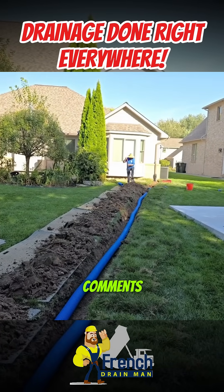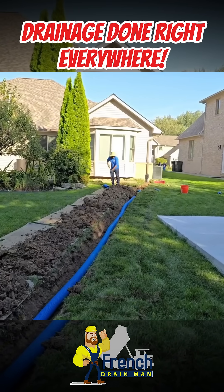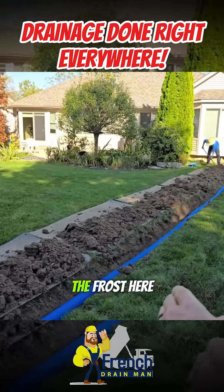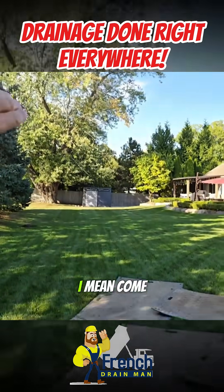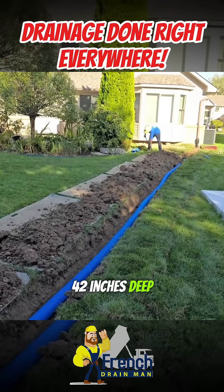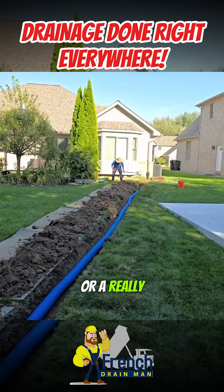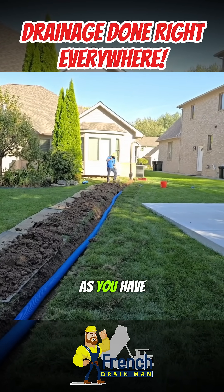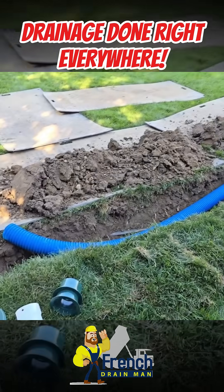People are always asking in my comments: I live in Canada or the northern U.S. — do I have to be below the frost? Well, how are you going to accomplish that? If you went down below the frost here, it's 42 inches in Michigan. Then you come up here and you're coming up — it makes no sense. The whole line is going to hold water even with this amount of fall because you went 42 inches deep. The only time you would go below your frost is if you had city infrastructure or a really deep ditch to run your line. I still don't feel that's necessary, because as long as you have good slope on your line, there's not going to be water left behind in the line to freeze come winter.